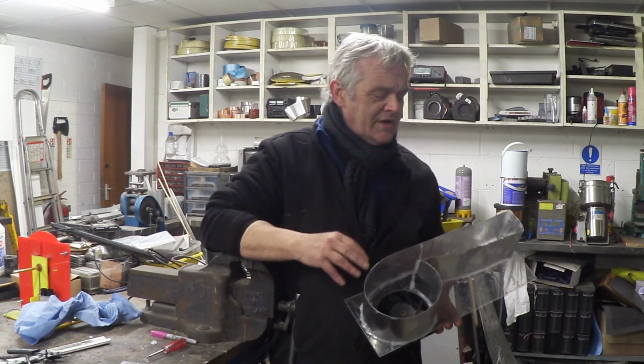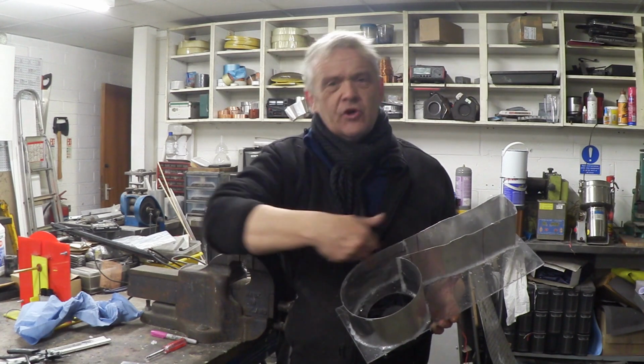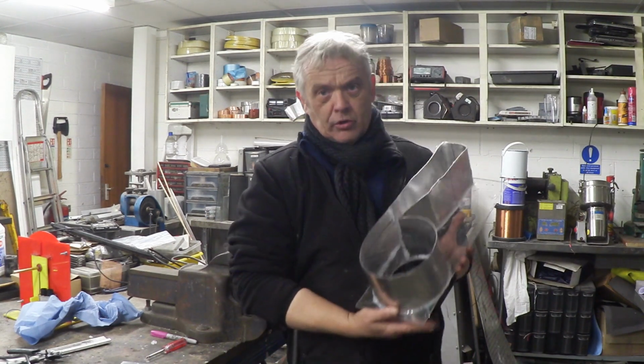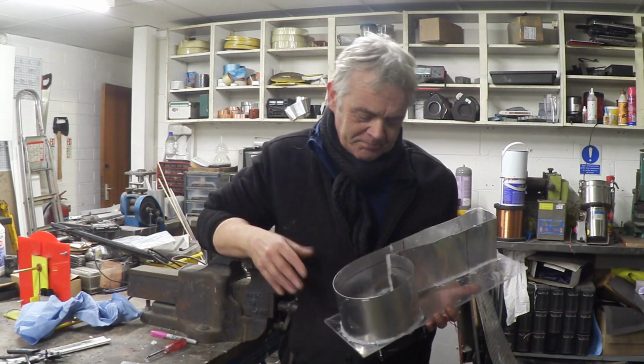Now, the principle here is the water falls a short distance, and when I held it a few centimetres above, it comes down there, and of course it creates a vortex by going around that involute. So the water's already spinning in the same way that it spins when it goes down your drain. And that spinning motion was then caught by this generator and we generated something. Now we got about 0.6 of a volt and it was a few milliamps or so.